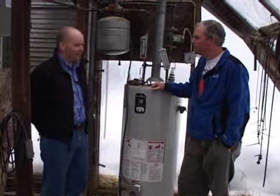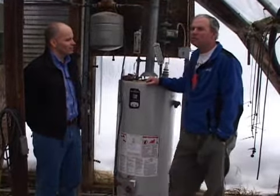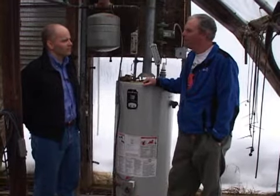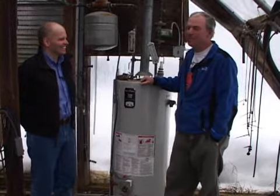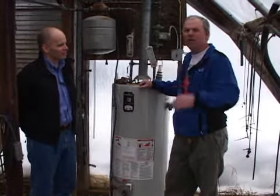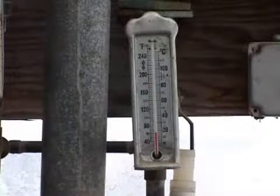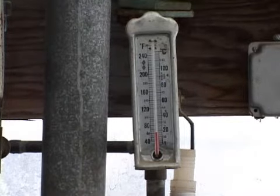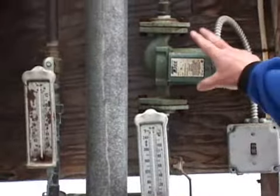Another environmental control is in-ground soil heating. The house gets planted in mid-March — between the 15th and the 21st — and at that time the ground is about 40 degrees, but it needs to be 60 to 70 degrees for growing tomatoes. They devised a simple system using a conventional 50-gallon hot water heater, the same type used in most homes, to heat the soil.